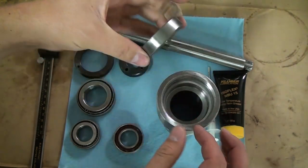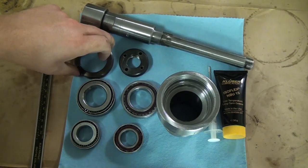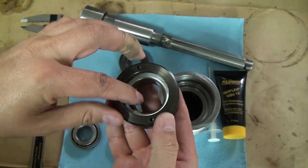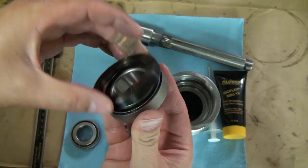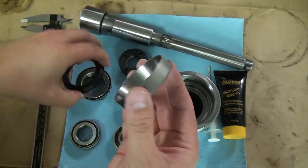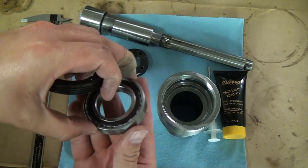There are two ways to go: you can make a large spacer or buy large shims that go in the quill before the lower bearing, but the problem is your bottom nut ends up not screwing down onto the quill very far — mine was only catching on a couple of threads. So I decided to go the other route, which involves pressing a spacer right on the spindle itself. This means you could be throwing your spindle out of balance by adding weight, and some people won't like that, but it worked well for me.